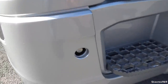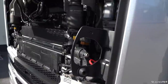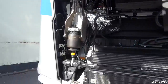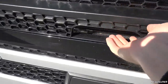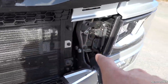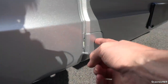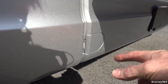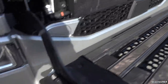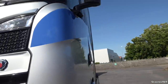That is the cab tilt pump, and your pump valve is on the side there as well. Let me just close that back up — and your coolant of course. Close down this top grille and pull down this step here. You'll notice as well we don't have any tie hooks here like we did on the R560. They're actually located in behind these covers; you've got to take them off and screw in your tie hook there, so you can tow it or tie it down if you're on a ferry maybe.